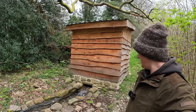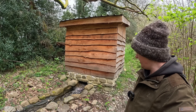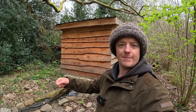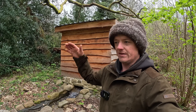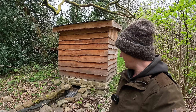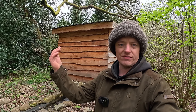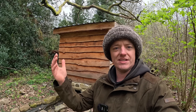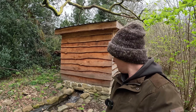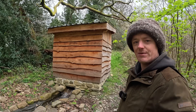Hey everyone, we are back at the hydroelectric project — the Turgo turbine. The customer's had a bit of an issue with the power dropping. It goes and cleans the intake, power comes up, and then drops off very quickly afterwards. So I've just come to sort that out. I think it's just going to be algae and stuff that's grown on the back side of the intake screens, so basically just cleaning the intake, but while I'm here I'll check everything over and give a little update on how much power it's produced.